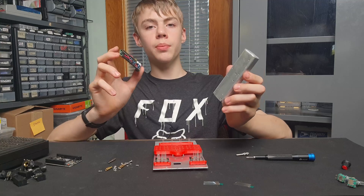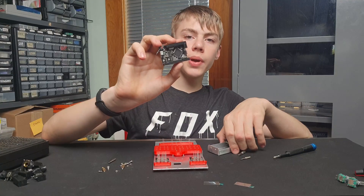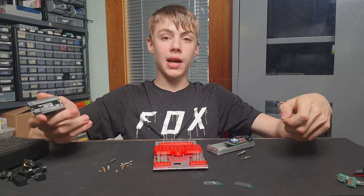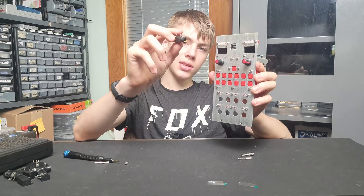Next is the shelf and the circuit board. I moved all of the chips from the prototype onto here. The microcontroller also mounts to this shelf, and I ended up going with the Mega Pro instead of the Arduino Nano, since the Nano didn't have enough RAM to run both screens. It's almost done — I've got the encoders installed, and the last thing is the jack sockets.